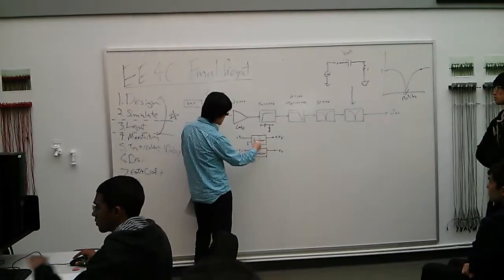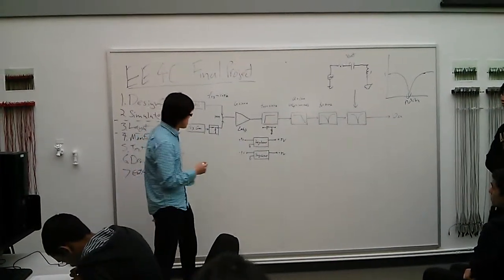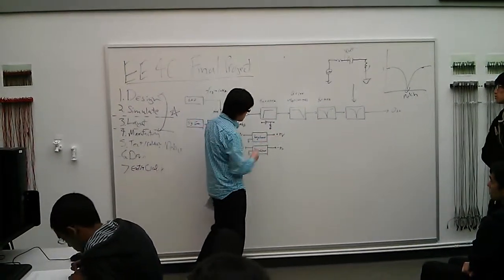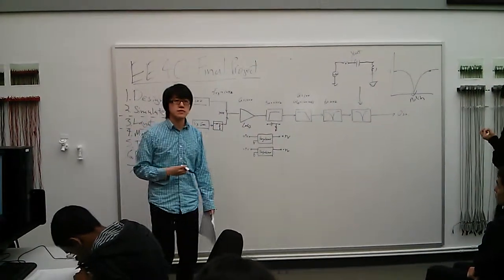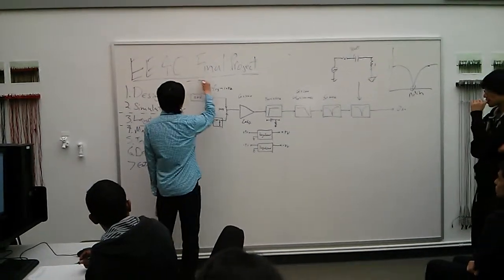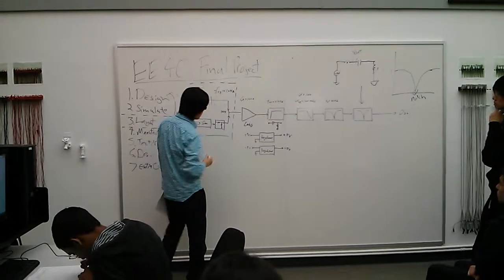I think the connection is very simple. It only has 3 pins: input, output, and ground. So input is connected to either plus 9 or negative 9 volt, and the output is connected to your op amp positive and negative rails. Okay, and this is something in the front. I think you don't have to include a simulation.